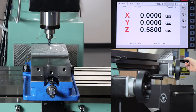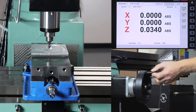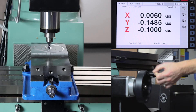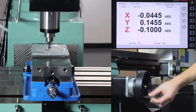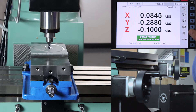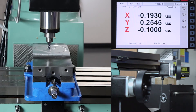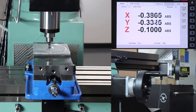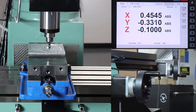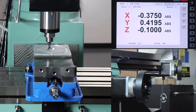You're going to see here that as it machines down into this pocket, I can stop when I get really close and make sure that this number here is what I have left, and if it looks good to me then I can continue on. It'll actually come in and start doing the machining into the part, and I'll start cutting the pocket all the way through. At any point when I know that it looks good I can just hit stop, go to CNC run mode, push go, and it'll do the machining by itself. Maybe when I finish this pocket I've got to check and see if I made any mistakes on the outside of the part too, so I can let it machine as it's going and when it's ready I'll just push stop again and go back to tracking.